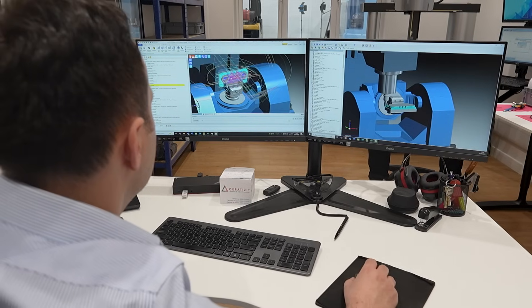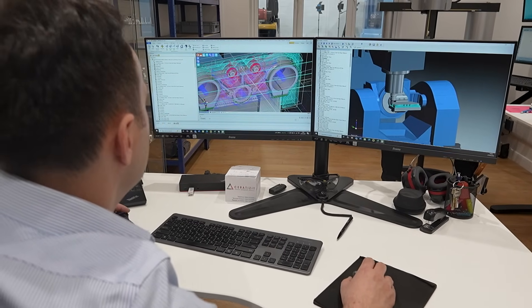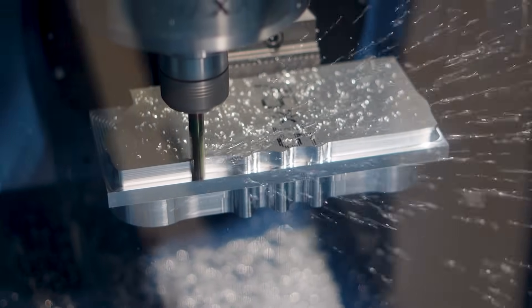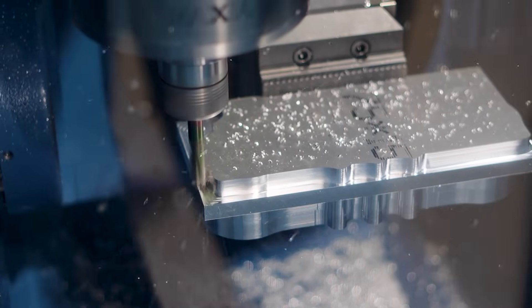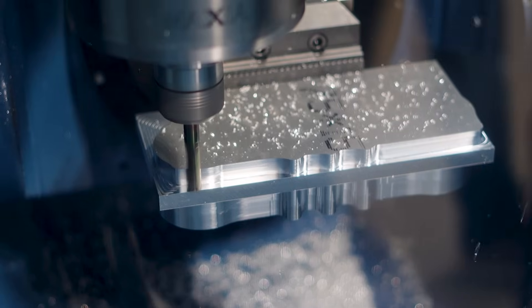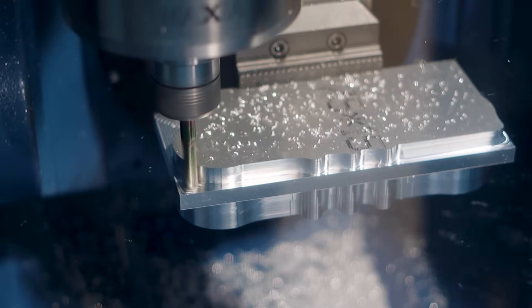And talk us through programming a machine like this master behind us, because there will be a lot of people out there using Edgecam just to program their parts, but now you have the pallet loader to deal with as well. If you keep your fixture manager up to date — and in Edgecam we're talking about the technology assistant and fixture manager, where you feed the right 3D data — then just a couple of clicks: you select your tombstone, you select your fixture, and you have a full collision check and toolpath trimming against the fixtures. Especially if you're talking about custom fixtures, it is just a couple of clicks.